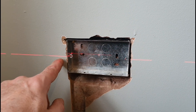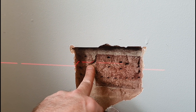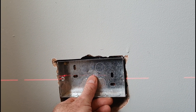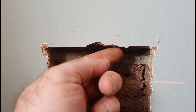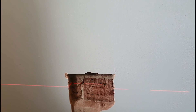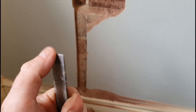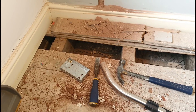That's the box nicely in. Now you can see the laser level line coming right through the holes, and we are going to have to do something with this hole on the left here because it just goes right through that perp. So maybe use the top one and the bottom one just to keep it all nice and flush and level. It is a 25mm box. The new-fangled MK socket says it fits in that box, and that's what we are going to use. There's a bit of horse hair here - I'll show you how old this place is. It was a bit of a nightmare chiselling through that, and obviously I've drilled some more holes, but look at the state of the chisel - it's pretty hammered and rounded off now. So much for keeping the dust down.